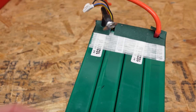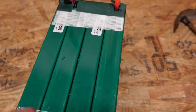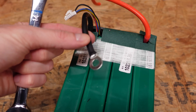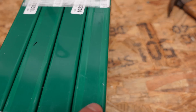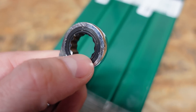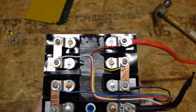While removing the negative terminal using a wrench, I accidentally knocked it into the side of the battery. A lot of people say there's no conductivity on these cases, or it's a high-resistance conductivity, but it made a pretty big spark. You can see the scratch mark where it penetrated the shrink wrap, and there's a tiny burn mark on the ratchet.